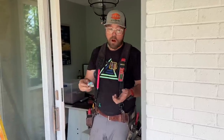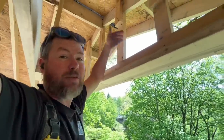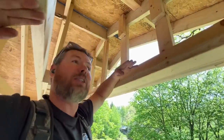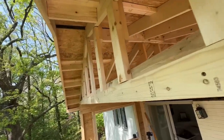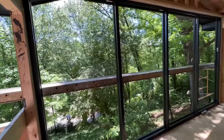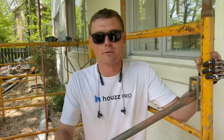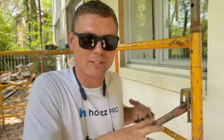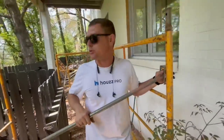Jonna was working up here and dropped his bit in this bush — Ray found it with his wallet magnet. I just got done framing in these little gable studs and I did them flat because there's no insulation value needed here — the insulation is at this level. We don't need the full three-and-a-half-inch thickness. This is it for this wall — it's just like a ceiling joist with a nailer and it's going to be sheathed. This entire front part is going to be a commercial glass storefront — all glass with black aluminum dividers, floor to ceiling, wall to wall.